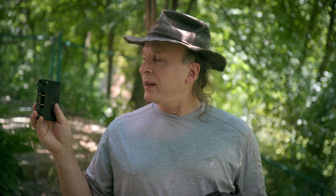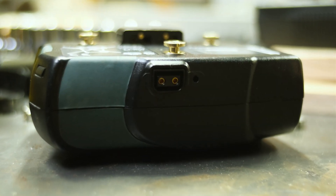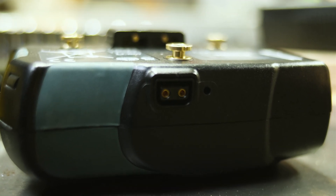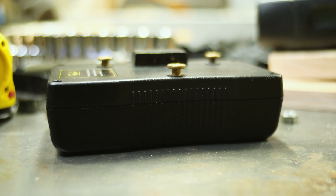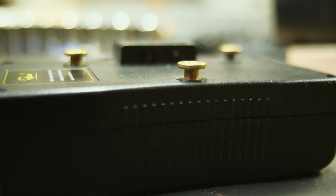These gold mount plates are standardized, so that's no problem. When you go out looking for imported battery plates, they run about $20–$25 and generally work fine. Sometimes with genuine Anton Bauer batteries the fit isn't always the best — it can be snug — but they'll wear in. The reason they fit very snug is that the spacing and the pins on the back of the battery tend to be slightly smaller on certain batteries. You can either replace the lugs with imported ones or sand them down a little bit, and either way they'll generally fit.